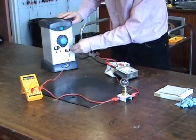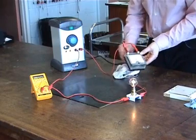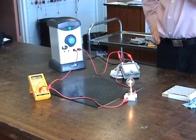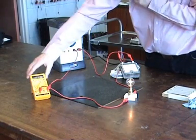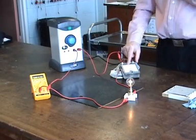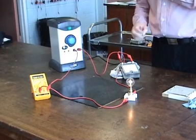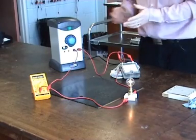I'm getting about 1.4 amps on both ammeters. Which is more accurate? You might think the digital is more accurate because it has two decimal places, whereas the analog is only accurate to the nearest 0.2 of an amp. So it would suggest the digital is more accurate. However, always be wary of saying something is accurate just because it's digital — there's no reason why digital should necessarily be more accurate than mechanical.